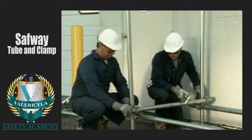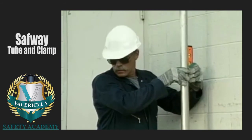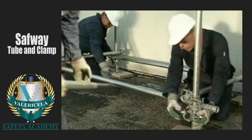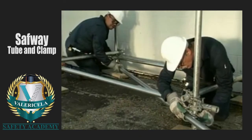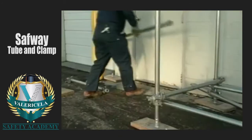With all the horizontals leveled, you should now check the plumb on the posts to ensure that all of them are vertical. If any are not, plumb with a level until they are. Once the bay is square, install a horizontal diagonal with right angle clamps underneath the runners to keep the bay square. You are now ready to erect the next bay.